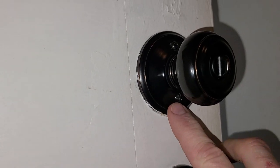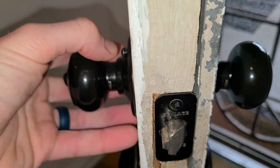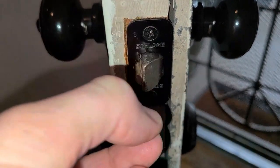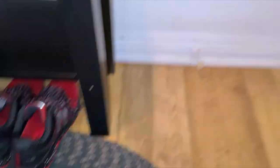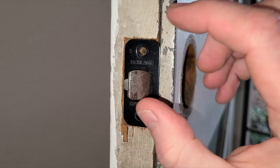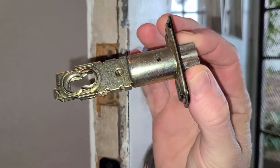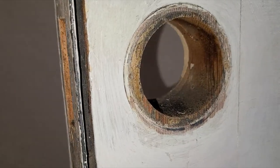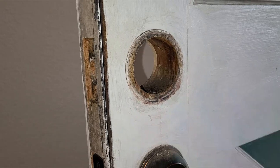You're going to loosen two bolts — most door handles have just two. After you're done loosening that up, you have one more here and one more here. And with two hands, pull left and pull right, and then this right here in the middle is going to be pulling out as well for a total of three pieces. Again, with those two pieces out and screws loosened, this piece just simply pulls straight out of the door — that's going to be your long center portion. And now your door is completely stripped bare.